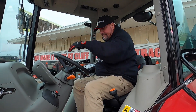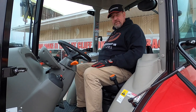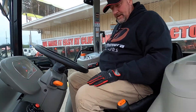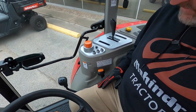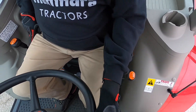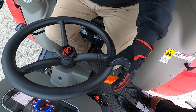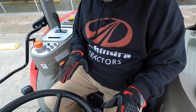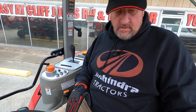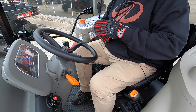This tractor is a power shuttle shift, so what that means is you have high, low, and medium on this side and four speeds on this side. Then all it is is forward and reverse by switching of the hand — almost like hydrostatic, no clutching involved. So you don't have to hit your clutch when going back and forth. Just try not to do that over seven to eight miles per hour.